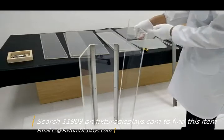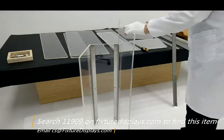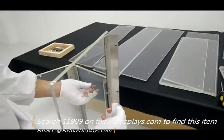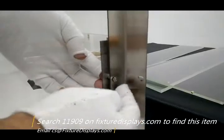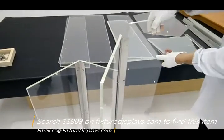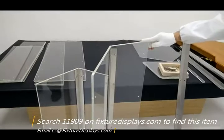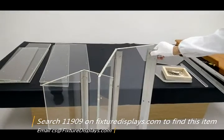Now we're going to pick another short metal bracket and then pick out part number three panel. I cannot stress enough — you have to make sure the orientation of the panel is proper, that they are all tapered in the same direction. Consider the miter cut as well. The screw will go through two metal corners and one acrylic piece whenever possible. That should be the principle to give you the best assembly strength and make sure the miter cut meets properly before you fasten the screw.